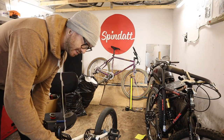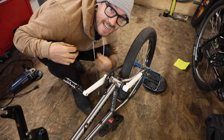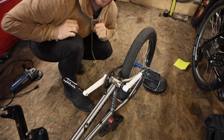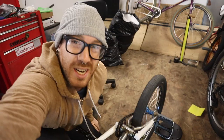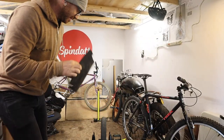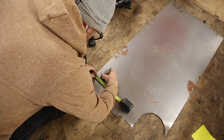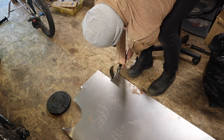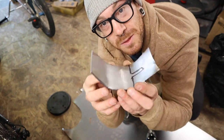The rack itself is definitely finished. The last part is to build just a little cradle that's gonna hold the bottom bracket at the end of the rack, with a little finger that's gonna sit in — we'll call it a wishbone here — that will hopefully keep it from rocking side to side too much. I'm just gonna rough out a shape with sheet metal shears and file, cut, and grind until I'm happy with it. Once I'm happy with the shape, I have this rubber stuff that's gonna act as a protective barrier. Getting a little bit of roll here is nice because I want it to hug the bottom bracket.